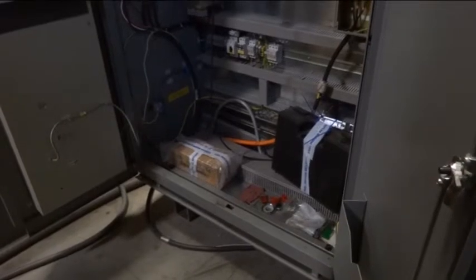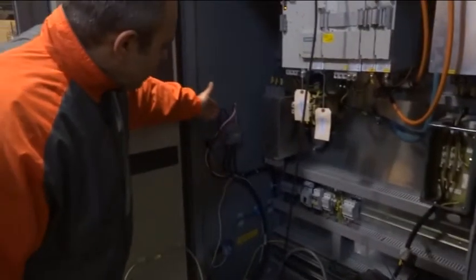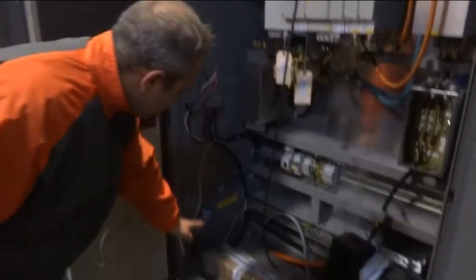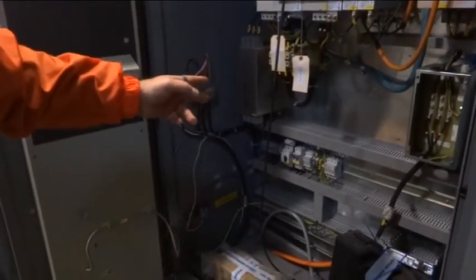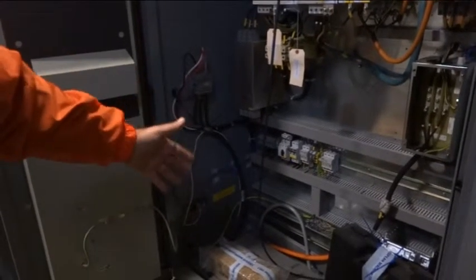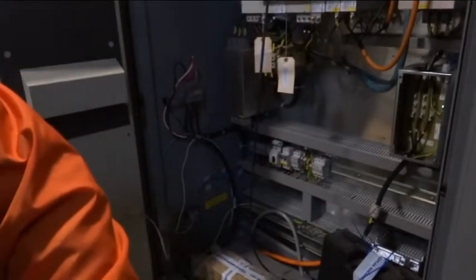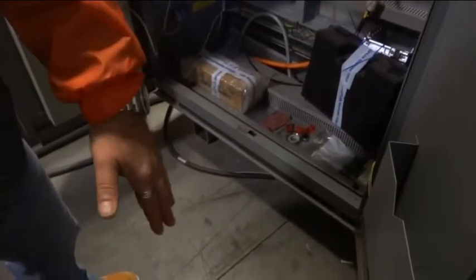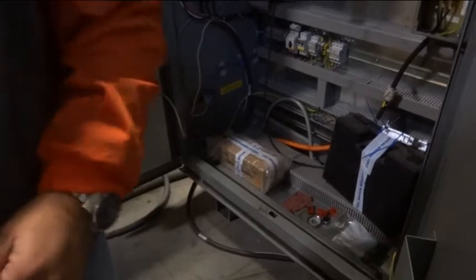But also look in the electrical cabinet. Gary, you know electronics anyway. So also 400 volt, L1, L2, L3. The neutral comes in also, and then the ground. So all machines and all components of this machine have neutral supplied from the transformer. X0 comes out as neutral, and then ground from the transformer. And again, you can separately ground this to an additional ground to the floor with a rod through the concrete. Some people do it, some don't, but that's up to you, and it's always a good idea too.